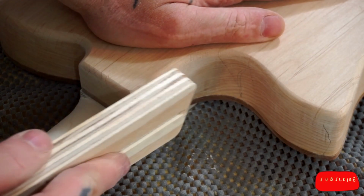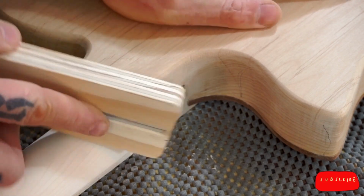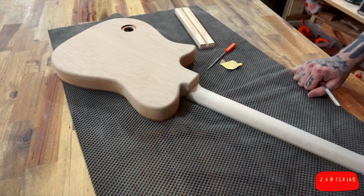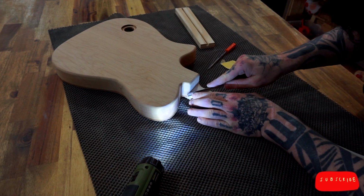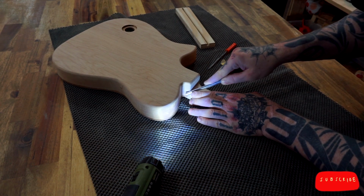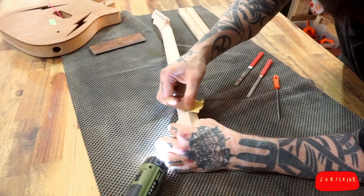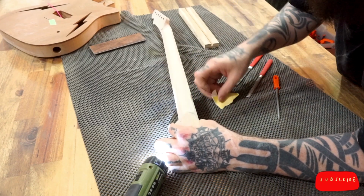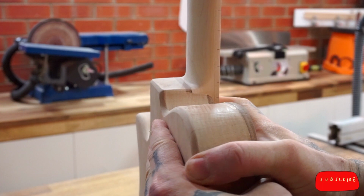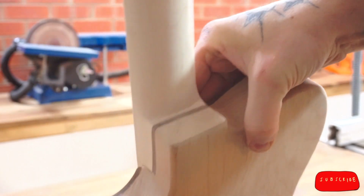There's still a tiny lip left, and I remove this with sandpaper. Using a portable light allows you to highlight any inconsistencies in your sanding. And there it is. After all of that sanding, carving, rasping, to follow are all of the other grits of sandpaper to get it to the stage where it feels smooth and ready to accept finish.